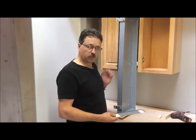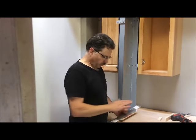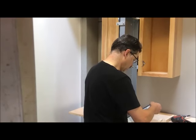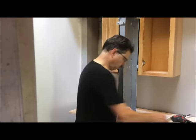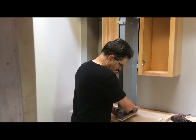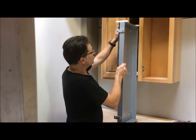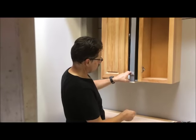Okay, now we're ready to finish the rack. This is the slip guide that's going to go in the bottom of the rack to guide the front edge. So first of all, we'll take the two-sided tape protecting strips off. Slip it into place. Keep it all the way to the front edge. That way your trays will slip right in behind it, and that will stay there. Just press it down on those screws. Okay, now we release the thumb screw.